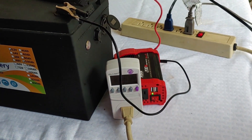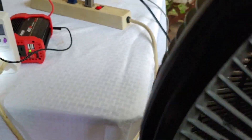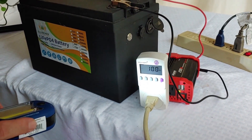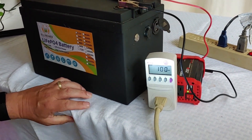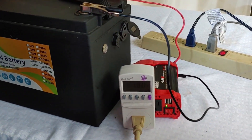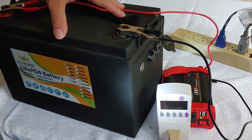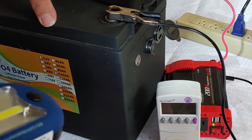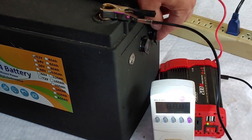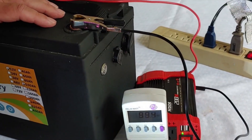We're going to turn it on. As you can hear, the fans have come on. We're going to check our watts, and the watts say 100 watts. So this should run about 12 hours if the discharge is correct and the battery is still good. It is eight o'clock this morning. We will come out around eight o'clock tonight. Of course, I'll check it periodically and make sure it is still good, and we'll see if it still has all the discharge capabilities it is supposed to have.